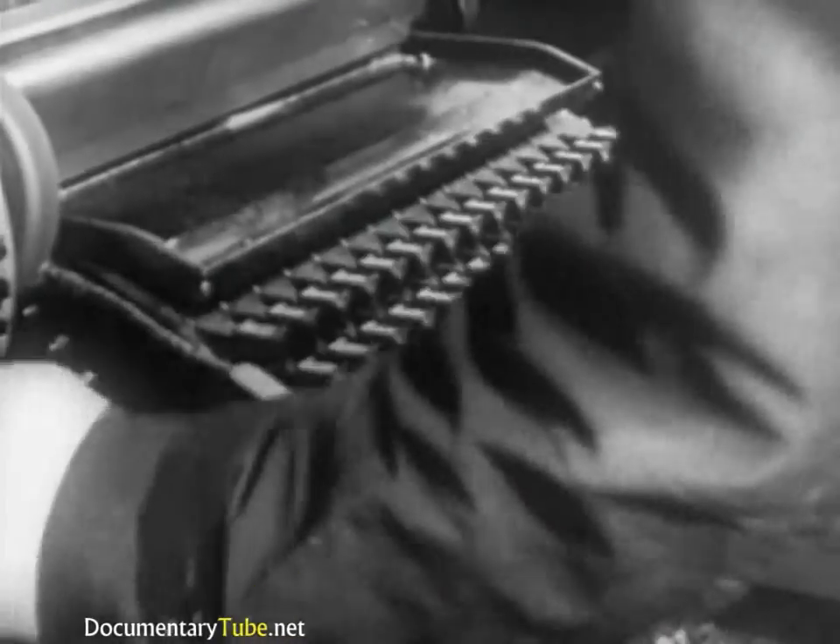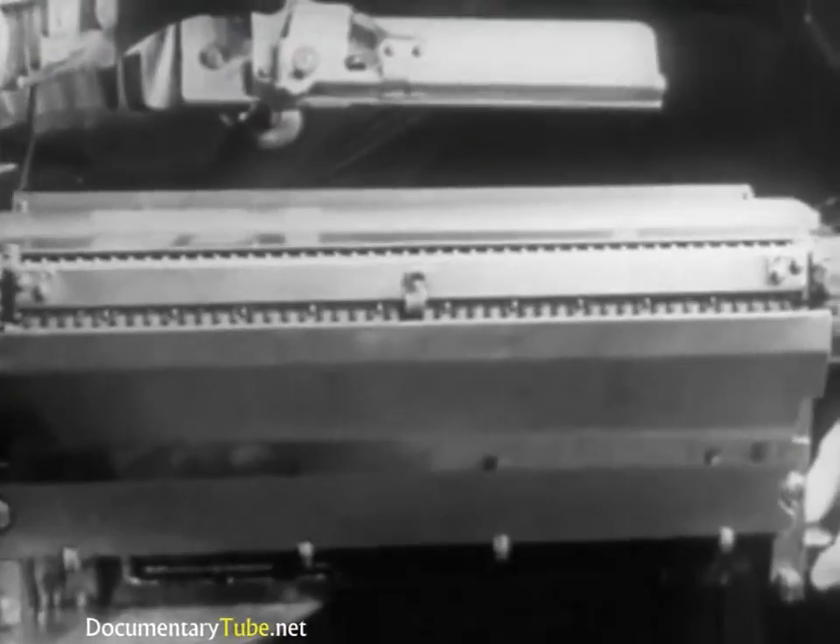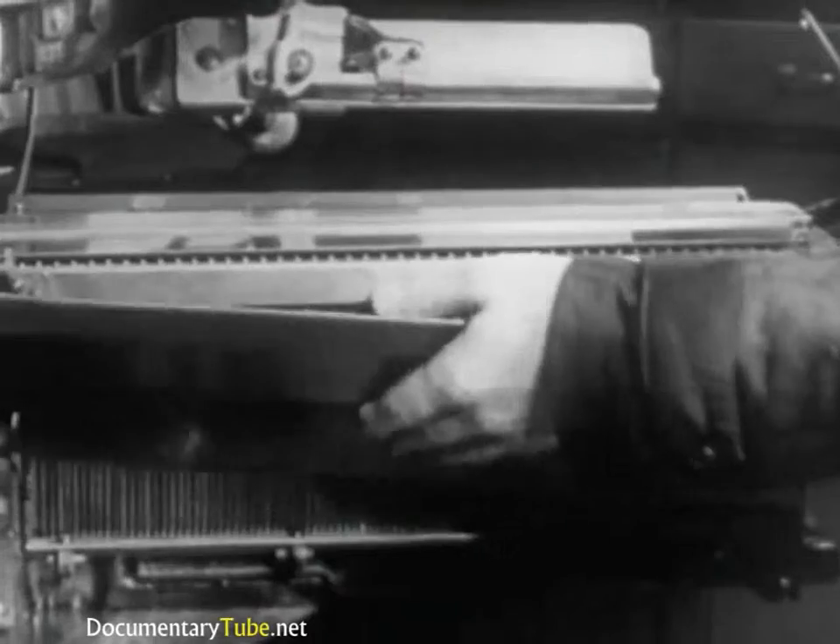The internal parts of the keyboard activated by one touch of a key to release a matrix from the magazine are: the key button, the keyboard lever, the key bar, the trigger, the cam frame, the eccentric cam, the rubber roller, the comb, and the key rod.